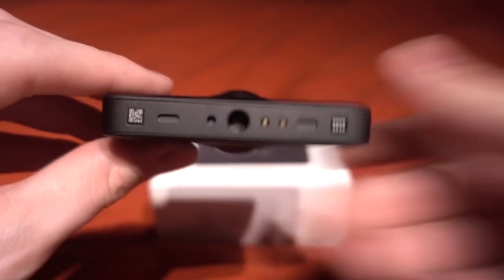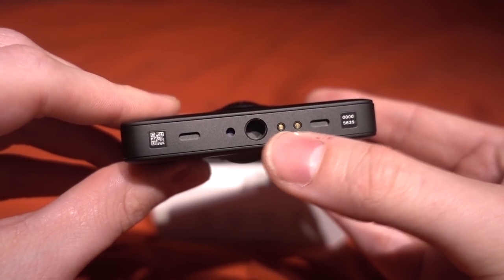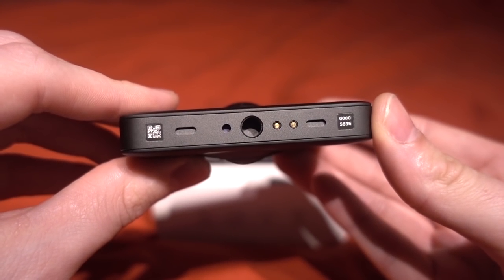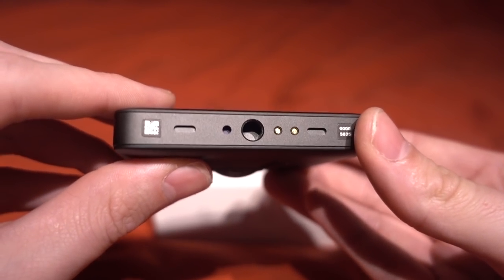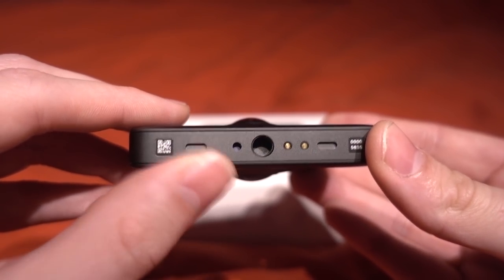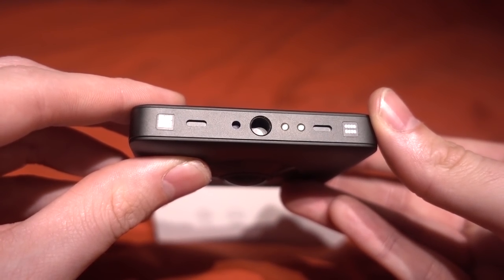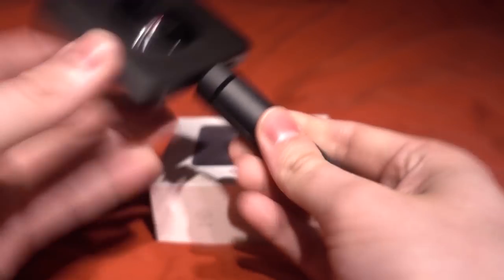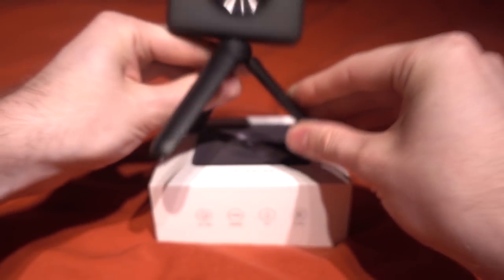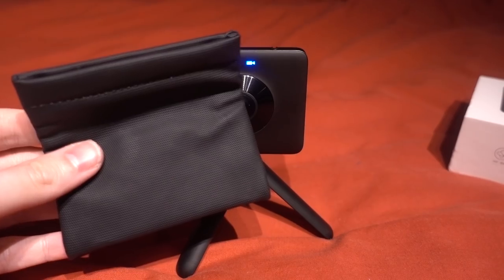On the underneath we have a standard tripod mount, which is how I connected it to my quadcopter. There's a pull-out tab on the side revealing a micro USB connector for charging. The camera supports Quick Charge 2.0 and acts as a mass storage device when plugged into a PC. It accepts up to a 128GB micro SD card — one isn't included, so I'm using a 64GB Class 10 card. The tab has a rubber seal making the camera splash proof and dust proof with an IP67 rating.